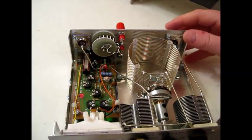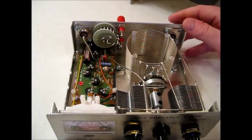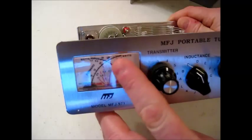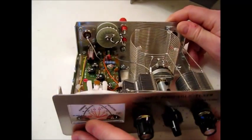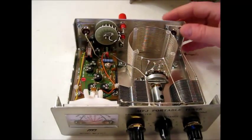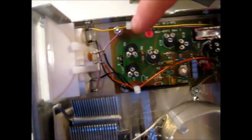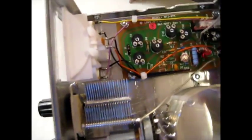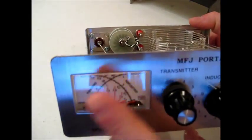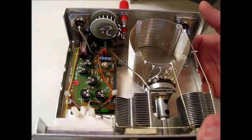I've got it open here because when I purchased it I had to change some jumpers inside. The needle scale is set to the 30 watt scale, and the radio I have is a 5 watt radio, so the manufacturer included an option to change jumpers to adjust the scale setting. I had to pull out this jumper here and plug it back into the other position, and also this jumper back here, and that changed the scale reading from 30 watts to 6 watts, which is perfect for a 5 watt radio.